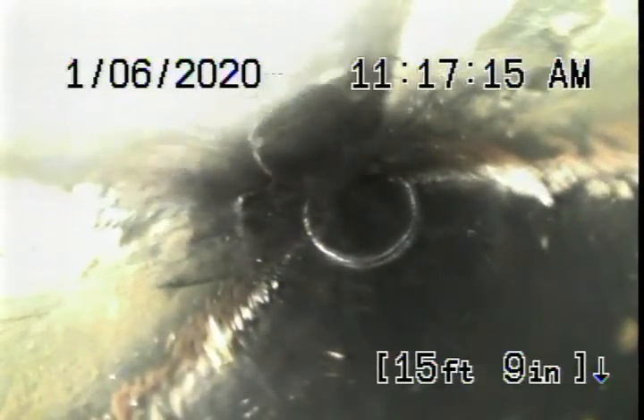There's a section that's a little flat over here. Continuing on — we're going to bring the camera back. This section of piping is now going to start going under water, so it has incorrect grade and should be repaired. You can see the water is pretty much halfway full in the pipe as it comes out of the clean-out in the front. We'll go ahead and stop the recording here.